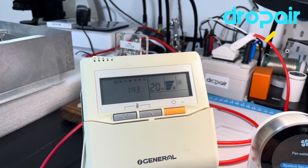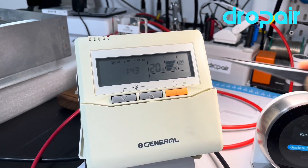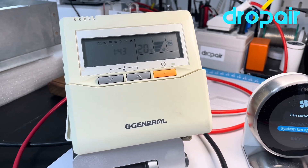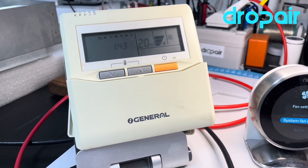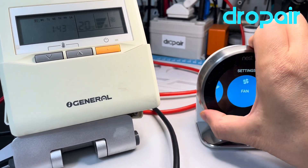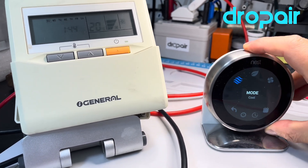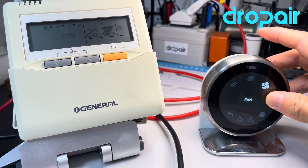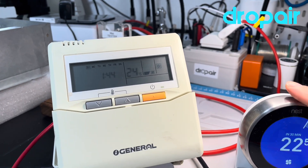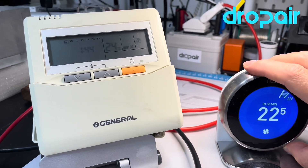It changes to medium and we hear the relay click sound. Now we change to high — it changes to high, we can hear the sound. Do not worry about the set point, because the set point changes with room temperature; when the room temperature goes down, the set point will also go down. Then we open the fan — low fan speed, no change to low fan speed.